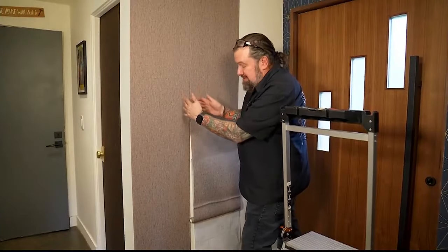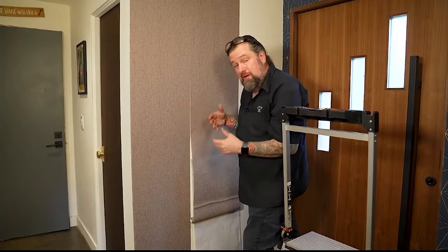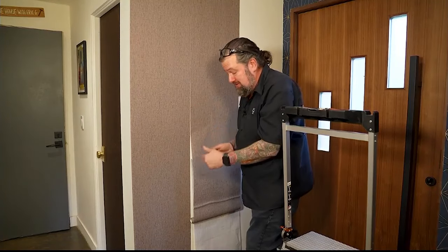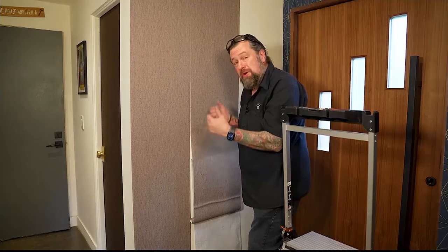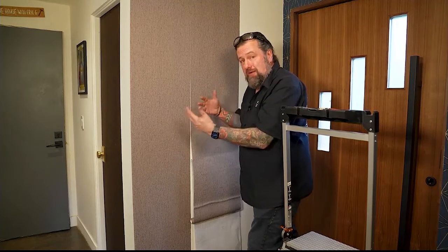Now that we've got two sheets up I can see that these are kind of traveling apart. The great part about peel-and-stick is I can pull this bottom up here, scoop this over and get them both down that way, so I'm not stretching this one too far. That way they're kind of in their relaxed state — even though this is vinyl, that'll make it stick longer.